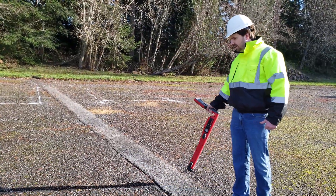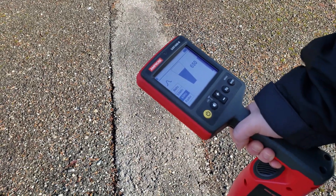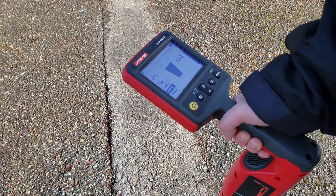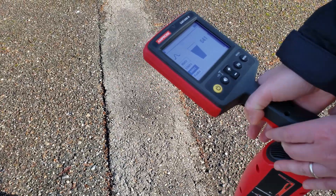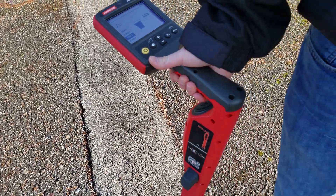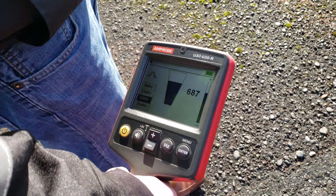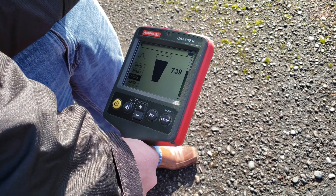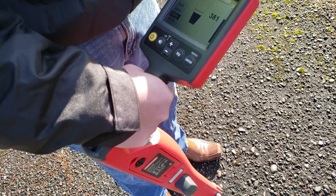Playing with the wrist: in this direction we have full sensitivity or full signal, while if we move it to the right we won't have any signal. If we go back to that direction and move the wrist 180 degrees, we get full signal again. This is a very easy method to detect direction. Moving to the opposite 180-degree side, we should have the same signal magnitude, meaning the wire is moving in this direction along a long axis that aligns with the handling area of our receiver.